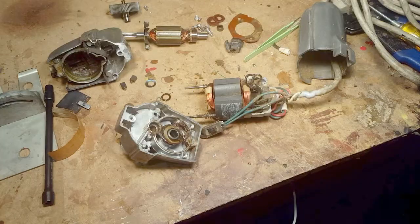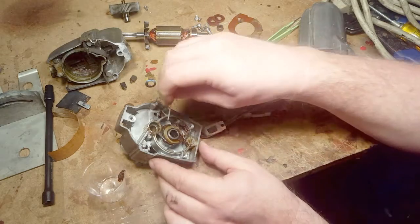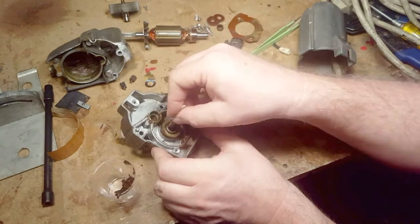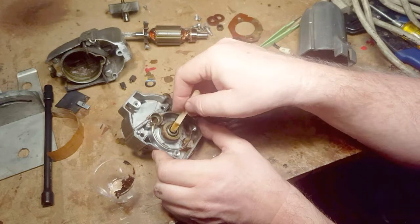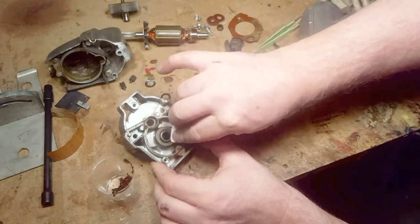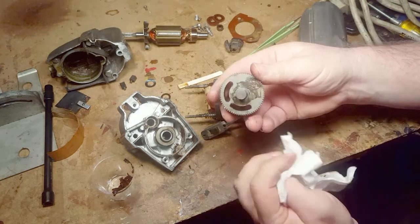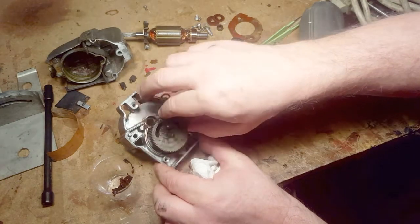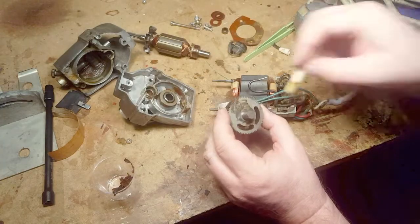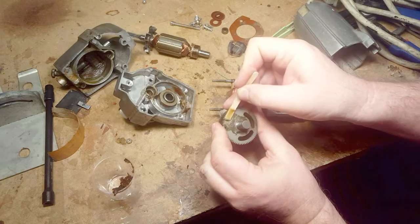There's a little phenolic shield keeping dust away from the motor. We've removed the light and now I'm pulling the grease out — it's all very dry. As I say, the machine was functioning; you could plug it in and run it. It ran a little bit rough, and I think it's because this grease is very old and dried up. It still works but it really needs to be cleaned up.